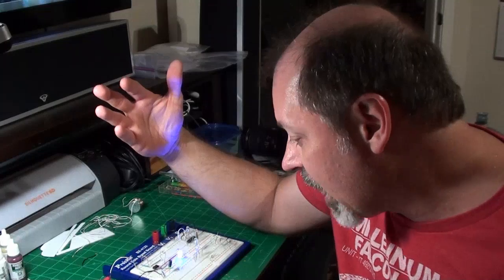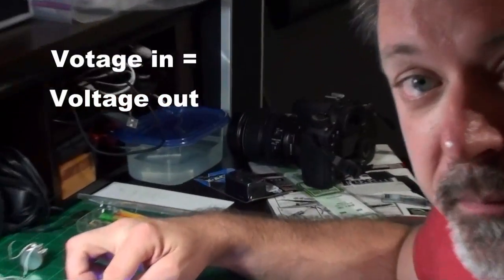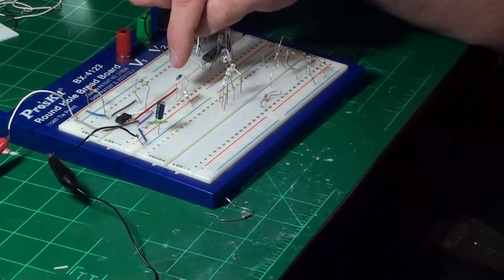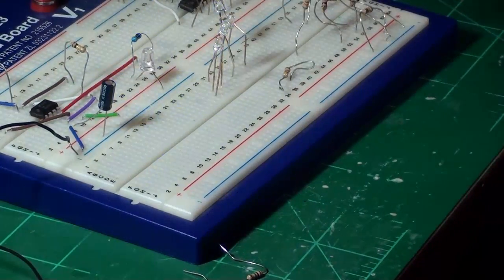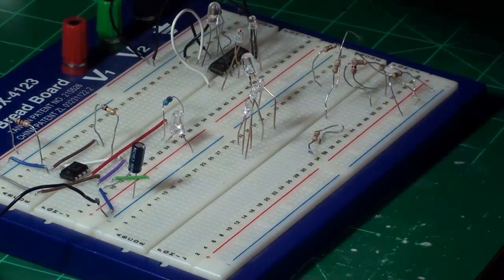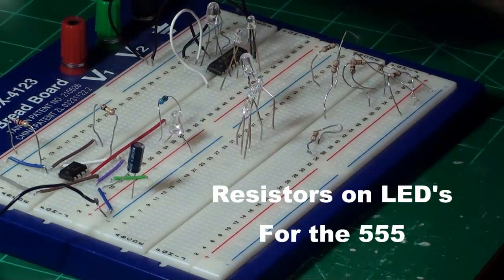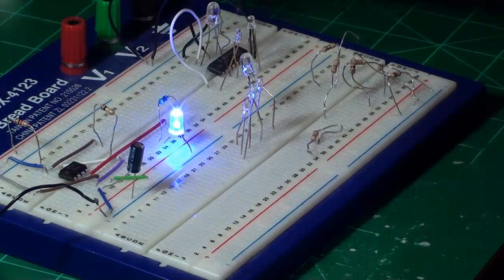One of the great things about the 4060 is it will regulate voltage. This one does not regulate voltage. This blue resistor right here is a resistor for the LED so I don't burn the LED out. I've got this chip running on 9 volts, and that resistor lowers the voltage across this LED so it is not 9 volts. You have to resistor your LEDs with the 555 — you do not with the 4060. That's one of the reasons why I prefer the 4060.